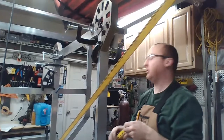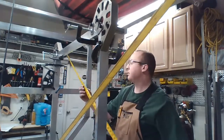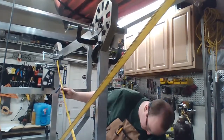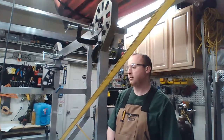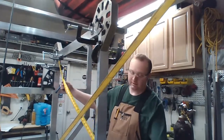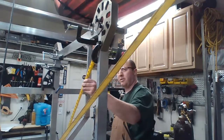Move you guys up here. Now I'm going to measure my diagonals. It's going to be 49 and a half. Get out of the way. 49 and more than a half. Oh, I hate to do it. Wait. This side is longer. It's 49 and 3/4. So a quarter inch out of square. That's only 36 inches long, which that's a lot.